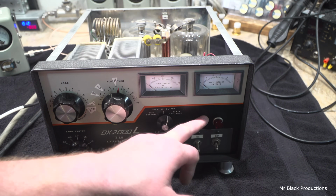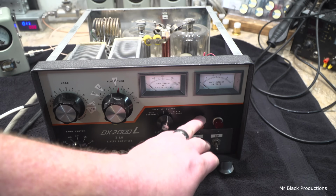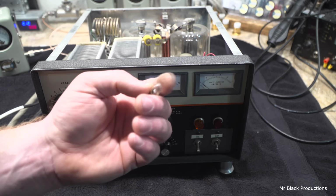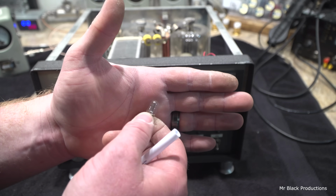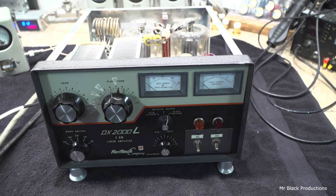Well, over here on the AC side, even though this bulb was in operation, the wire wasn't even hooked up, because it had a lamp in it, an actual physical element. The thing that makes these so cool is there's like 50K worth of resistance on the shield for this neon element. That's an actual little neon element in there. It's full of a little bit of gas, and there are no physical filaments between the two. Well, when I saw that high resistance, I went, oh, son of a, because I was trying to make it work with a light bulb. I thought, man, am I gonna have to replace these sockets? Then I measured the resistance.